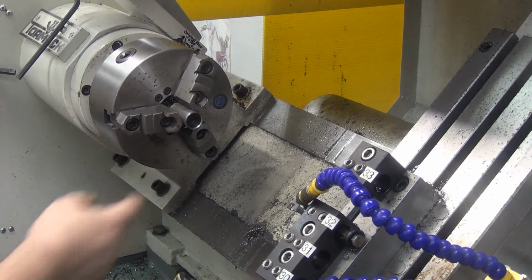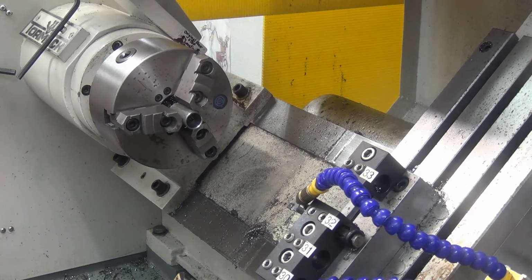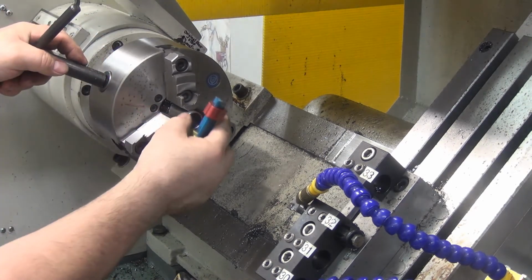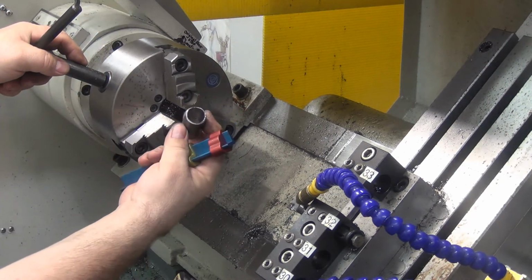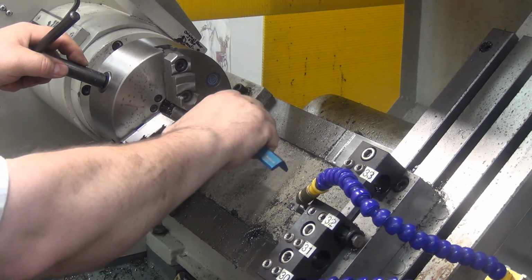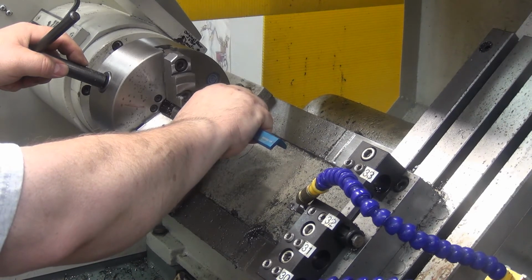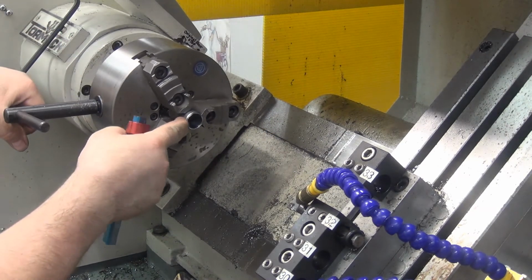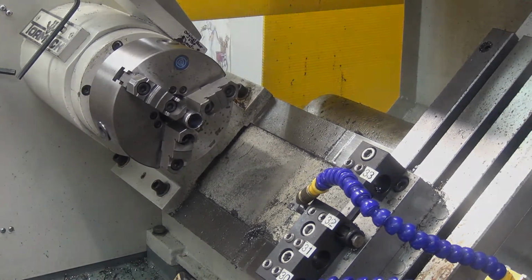And I do that deburring tool fairly aggressive there. Well, I already explained that. So it's got a nasty burr there, which throws off the depth stop unless you kind of catch it on the little flat that's outside of the burr.